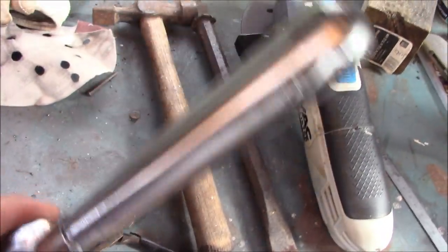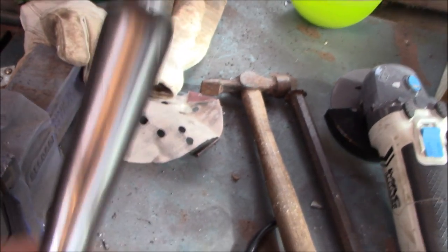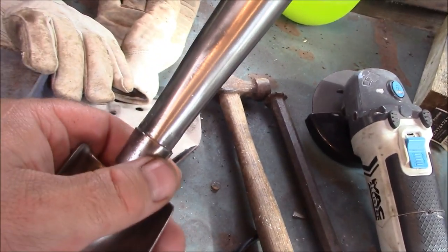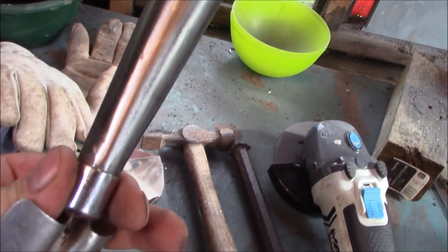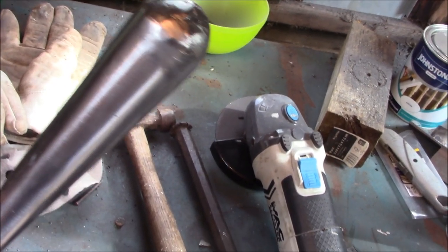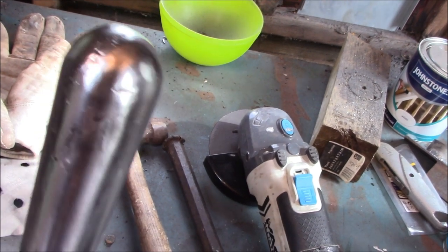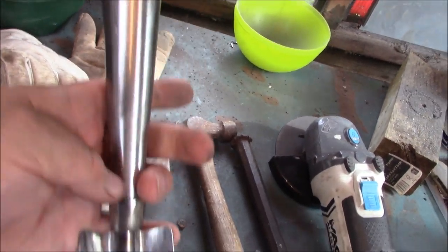There's the handle. I'll sand it down a little bit but there it is, all welded up at the end - nice and round so when you hold it, it's nice to hold. I've brushed it all down so it's clean and I've got the galvanising off. All I need to do now is tape up around the piece of steel and paint it with some cellulose paint so that in the bad winter weather it won't go rusty. So that's how to make a handle for a trowel which will hopefully never break again. I'll paint it up and show what it looks like finished.